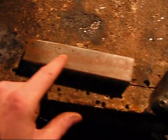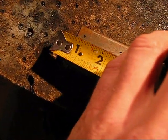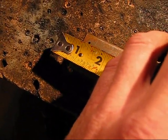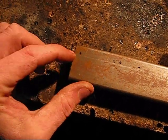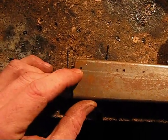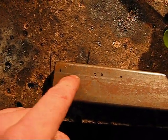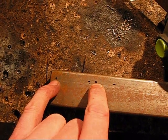I have it cut at six and a half inches. Then I'm going to drill down — it looks like about a quarter of an inch in. I measured in about a quarter of an inch here and measured down three-eighths of an inch. It's actually at a quarter — I didn't really measure that part but it's at a quarter here and down three-eighths of an inch. I'm going to put a hole here and a hole here, measured out at one and three-quarters, which are the eyes of the hydraulic brake master cylinder.